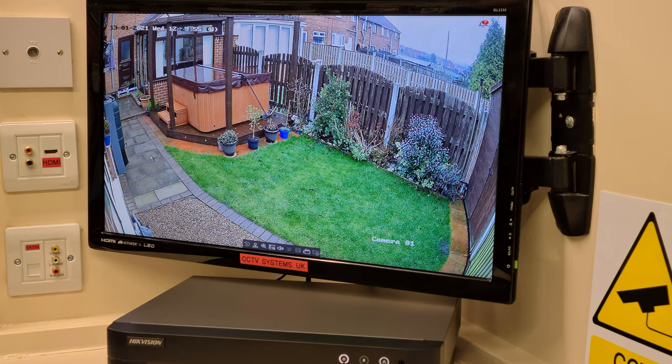So there you go. That's another video on Acusense Hikvision DVRs, how to get the best out of them, how to set them up nice and simply. Just remember, press the apply button every time you change something, and don't be afraid to mess with the sensitivity and the time thresholds and things like that, because you won't hurt the DVR. As long as we press apply afterwards, you'll always be okay. But remember not to have the target detection, which is human and vehicle. And of course, you can have both going at the same time, but you can't have them on different channel modes. So if you've got them on motion detection, you can't have them on intrusion or line crossing, and vice versa.